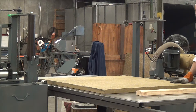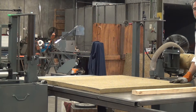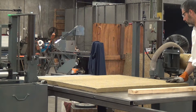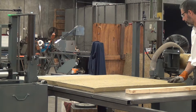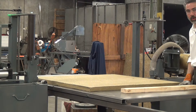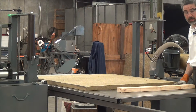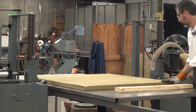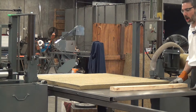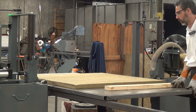A human operator, including me, will be a little jerky — tend to surge and duck and push. The variability of speed translates through to the cut surface. The varying cut pressure, particularly if you hang up and then surge, can cause the blade to rise or drop in the cut. A steady pressure helps ensure a better quality cut. This light duty table uses steel bearings rolling on steel rails. It's inexpensive, easy to put together, and very low profile, but the steel on steel gives a little bit of a rough ride. The heavy duty table uses high-durometer hard urethane casters, giving a smoother ride for light or heavy workpieces.